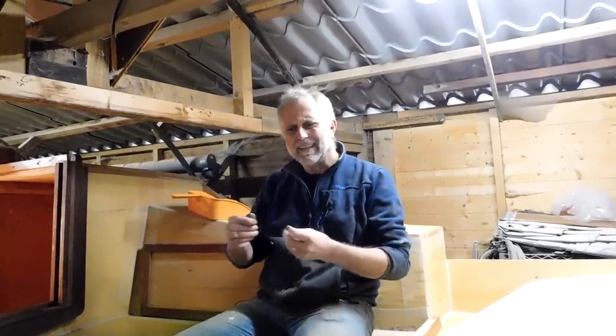Shakes, the boards that I buy do have some splits at the end from the drying. I just mill it accordingly to take them out. One or two bits I have to sort through the wood and throw out because there are shakes in there that I don't like the look of, but the vast majority of the boards I buy are usable. I find it easy to work with. I really have no issue working with black locust. I would certainly do it again.